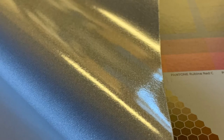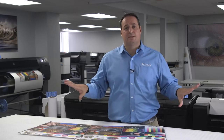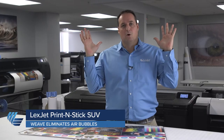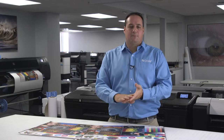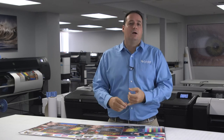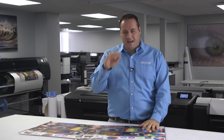The difference between LexJet Print and Stick SUV and a regular wall film is that Print and Stick SUV has a weave to it — it is a fabric. So the natural airflow doesn't need to go out to the sides like it would with adhesive vinyl; it can go right through the product. If you have an air bubble right in the middle of your panel, you can just take your palm, smooth it over with your hand, and voila — no more air bubble. Also, there's no overstretching it. With adhesive vinyl, if you've pulled too hard at the top of a panel, by the time you get to the bottom it might not match the panel next to it. With Print and Stick, it doesn't stretch or overstretch, and there's no need to worry about half moon shapes where you'd need a heat gun — that doesn't happen with fabric.